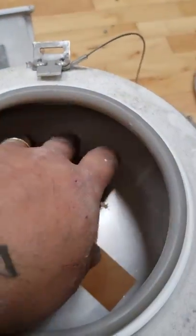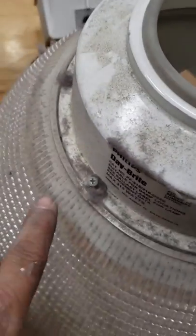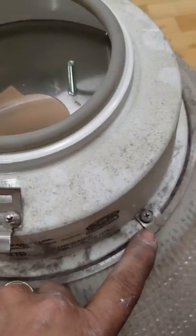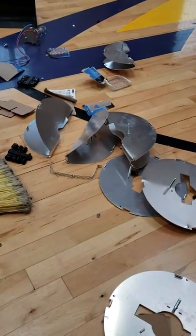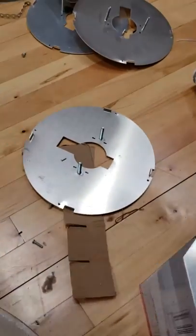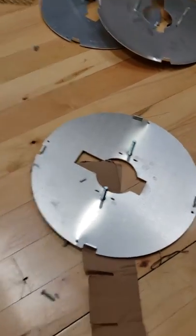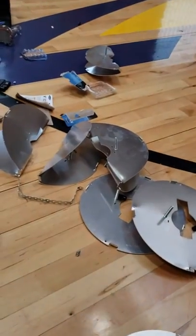Then remove the inside plate so the new light bulb can fit. Loosen all four screws and the plate sinks in. If this part doesn't come off by itself, you've got to bend it and remove it completely. Sometimes the white part will fall in and you can remove it whole, but if not, bend it inside and it will come out.